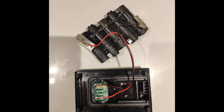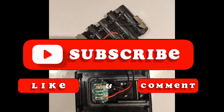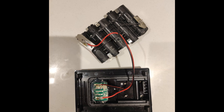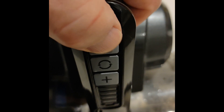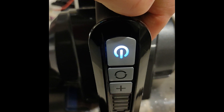What I've got now is a direct feed of the batteries out onto the negative and positive pins of the battery pack. So in theory, if I plug this into the vacuum cleaner, we should get some response, because it's no different wiring it directly than having the power there when the BMS is wired in. And this is what happened — it certainly didn't like that new configuration without the BMS being in place. It just refused to start.